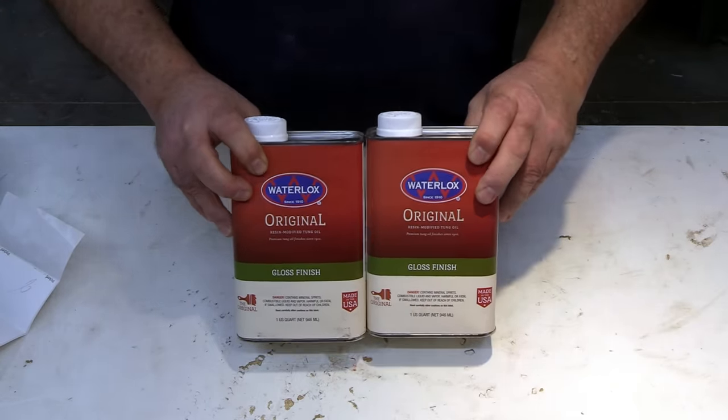Since we're mounted outboard, of course, things aren't running as true as they were before. So that's all I'm doing here on the opening. I figured, well, okay, I'm here, I'm going to try the Hercules and try to smooth the wall a little bit more, what I could reach with the Hercules. And then you'll see me switch out to the bowl gouge. Of course, both the steel and the handle are longer, so you've got some pretty good mechanical advantage and can hold on to it.